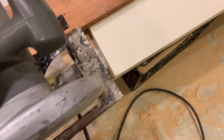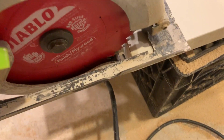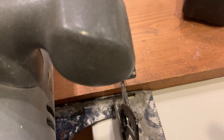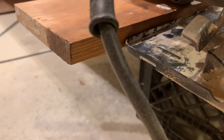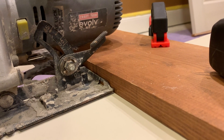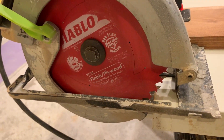So what you want to do is take the saw and place it — I want to cut approximately one inch off the door, so I pre-measured that mark and come in one inch. The guide will ride along the 1x4. I've set the depth of the blade so the saw will ride above the board — if you set the full length of the blade down, the saw would rub on the board and wouldn't have clearance. Setting the blade a little shallower is a good idea on most things you cut.